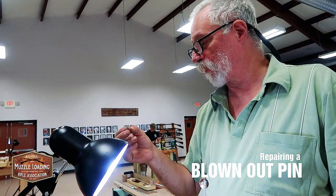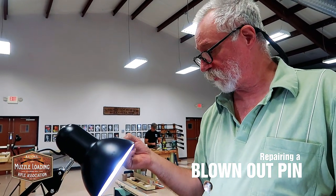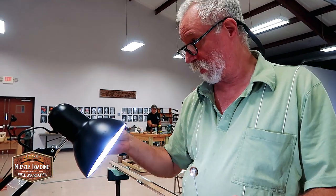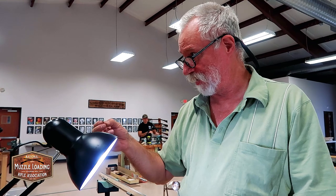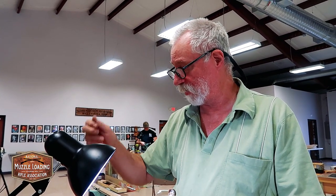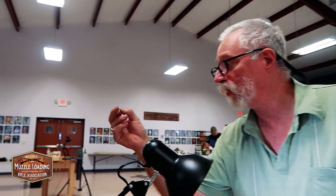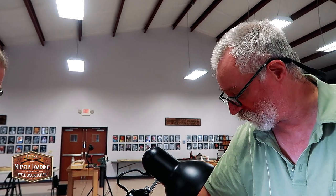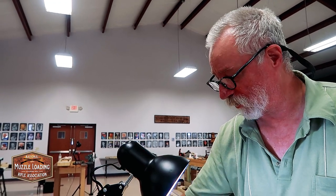We're going to tuck some new stock up in a drill and use it like a Kentucky drill, milling machine, or a lathe, and we're going to lay a file on this to thin them up a little bit. You'll need rounded tips — a little tapered tip on these — so it'll follow the hole.